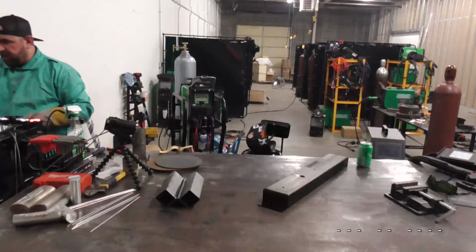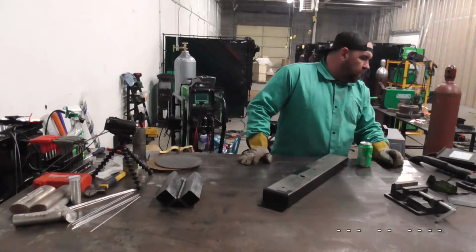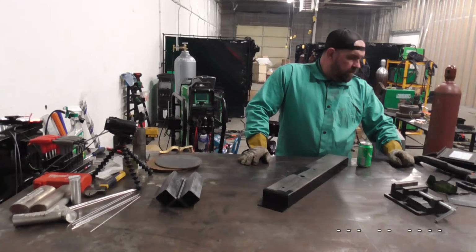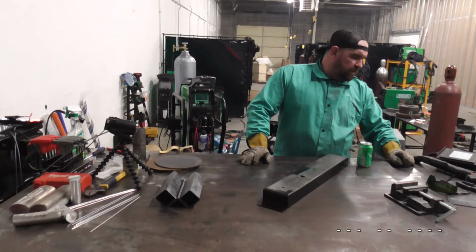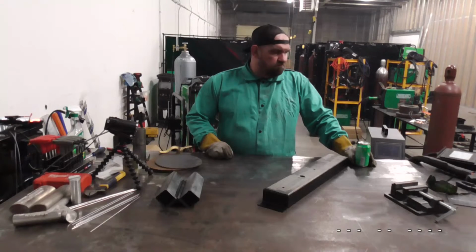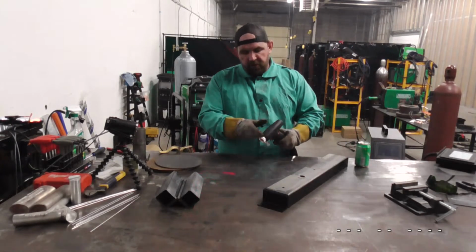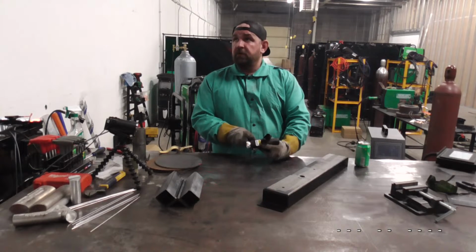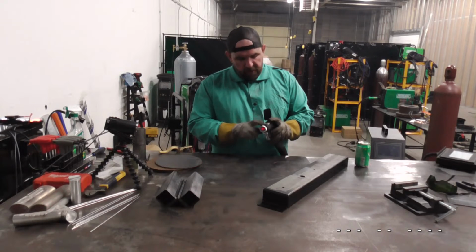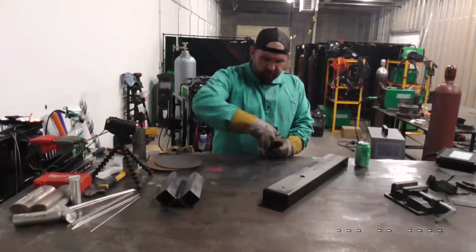How many hours before you need a new laser? I don't know. I don't have a ton of use on it because I've got other responsibilities. But we've got a couple of them out where guys have been using them for 3 or 4 months now. No problems. The main thing you're going to go through is your protective lenses and your focal lenses. We've got like 6 different focal lengths. The protective lenses come in 10 packs, and they just pop out in this little cartridge.